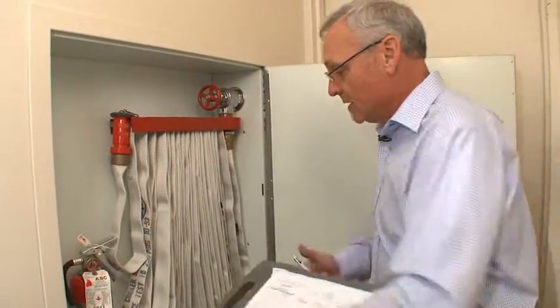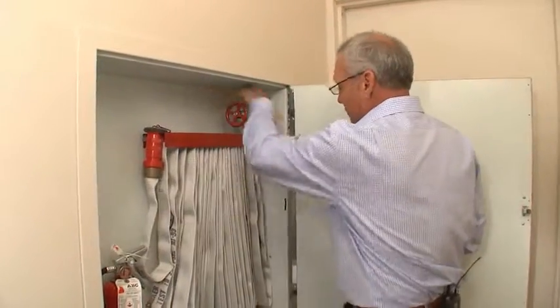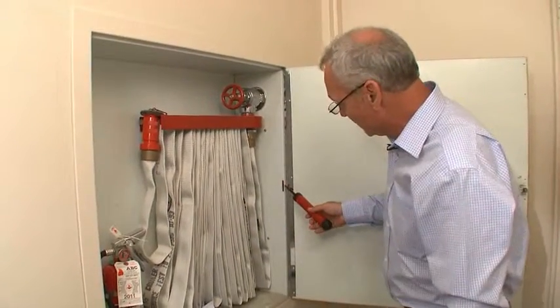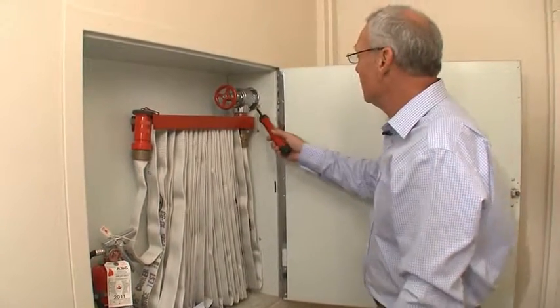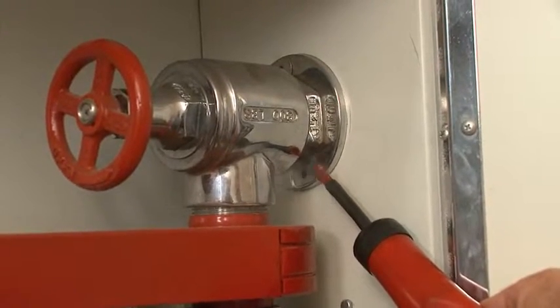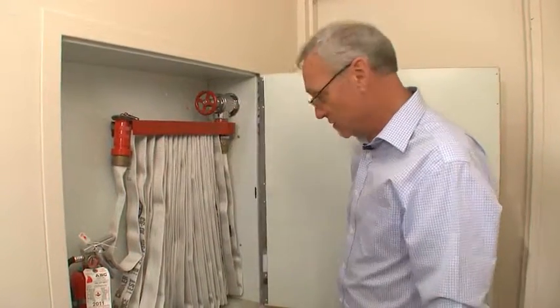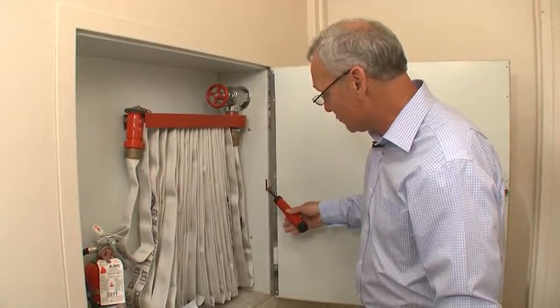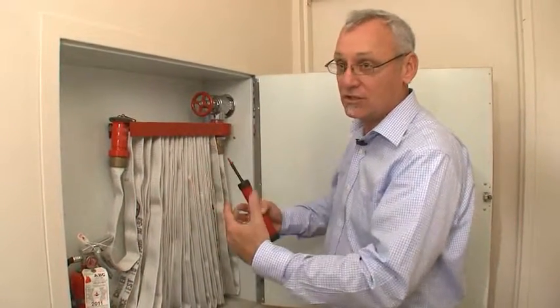Here's another area of concern — fire hose cabinets. This is a plumbing shaft that leads floor to floor. We try to tie in the wall to the shaft itself by sealing the cracks, gaps, and holes around it — we'll even caulk around the trim. Testing it, the gap around here is quite dramatic, and it should be — we're at the top of the stack where pressures are greatest. A lot of times there's no escutcheon, just an inch gap around the whole perimeter, plus screw holes, seams, and the latch. We're compartmentalizing this shaft so it's not pulling or pushing conditioned air from each floor.